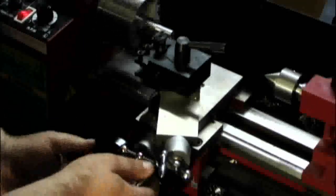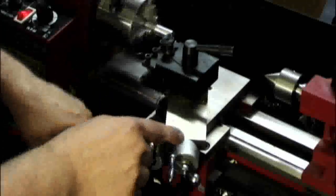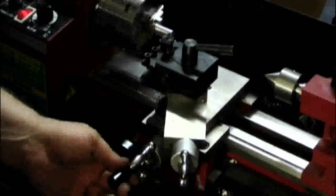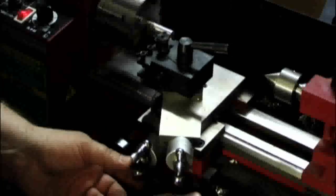Let's continue cutting now. I'm going to slow this thing down. I bring the tool almost up and bring this back to zero. I should be cutting in a little bit. I'm going to bring this back to zero and then add another 5 thousandths. Watch the counter come around — we'll start at 1 — and I'm going to start feeding in until we want to stop.